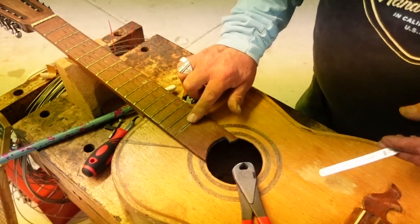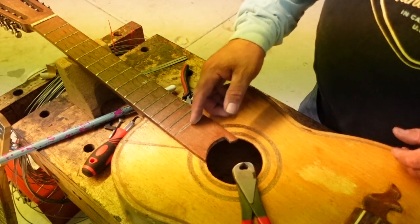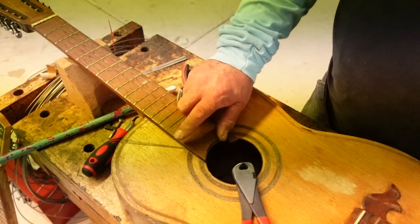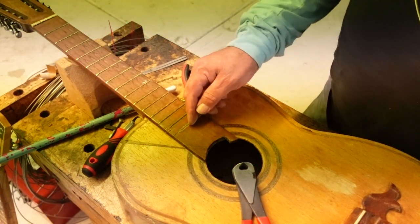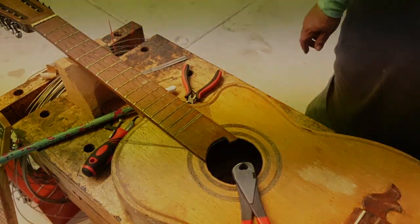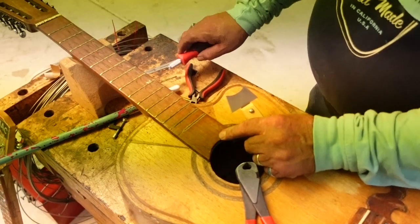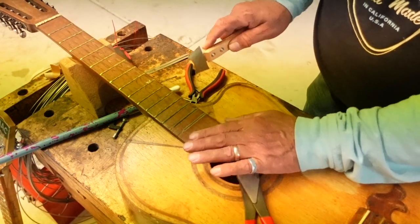There is really not that much chip-out. I'm going to take a little bit of sandpaper lightly. Notice that fret only went in to there and this one to here — so that's kind of an ornamental thing. We're going to knock this down a little bit, because if there's a bit of chip-out and you hit it sanding, you're going to rip something off. A couple little tools: this one I can use to pull out and clean the fret channel, and I can also take this fret saw and just pull it through once or twice.